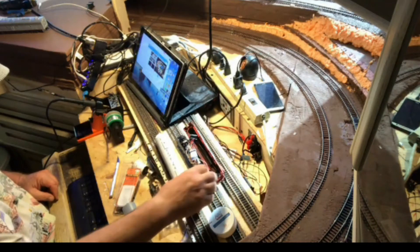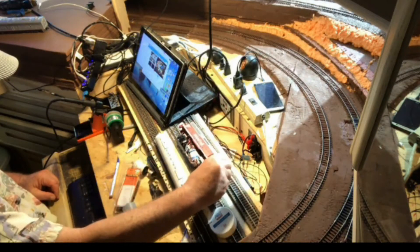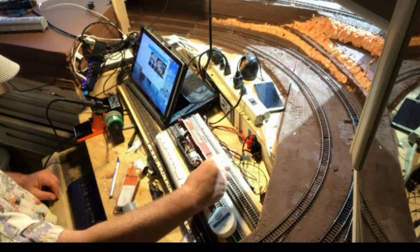It took me three locomotives to build one that works. Tomorrow I'm going to take what's left of the other two and salvage them for parts. Then we move on to an Athearn Blue Box SD45 — that was my first DC-to-DCC conversion — it's very crowded in that shell and it's binding on the drive wires and the decoder is binding on the drivetrain, so I'm going to redo that as well.